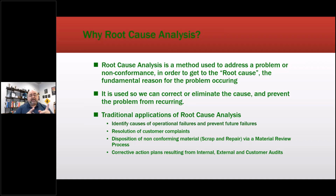So we used that in a discussion to go over and look at the records. And sure enough, they had increased the temperature of the process by 5 degrees centigrade, which was apparently enough, for the length of the oven, to overcure the material and cause it to delaminate. So, there are things that can occur like that.